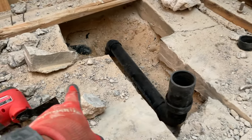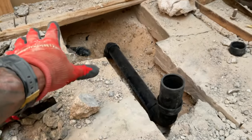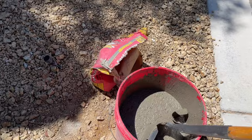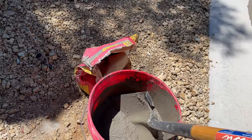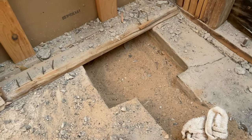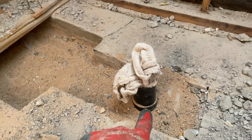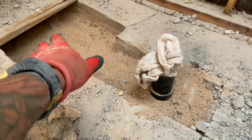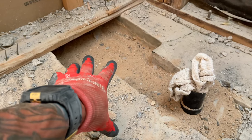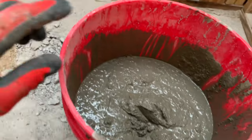We got this set 16 inches on center on a 32-inch shower. This will be backfilled and then we're ready for the plumber or whoever's going to finish it — the tile guy to come in and do his shower pan and set it over that. He can place the shower drain at whatever level he needs, so I gave him a few inches to work with. We're mixing some ready-mix concrete to a smooth consistency, just did this in a five-gallon bucket. I backfilled with a lot of clean dirt first, got about two-and-a-half to three inches, filled all the way around so we can still dig a little bit if we ever have to reset it. I'm going to backfill all the way to about here, float it level, and that will give the tile guy something to work with and a solid surface to set.